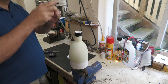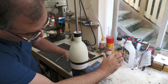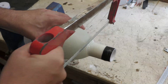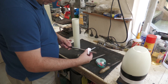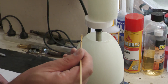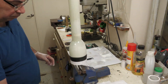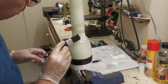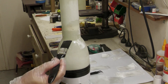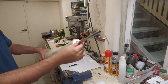Now it's time to attach the bottom end cap to the motor tube. The original mold is used as an alignment jig to make sure the motor tube and the end cap are aligned — we don't want any off-axis thrust vectors. After the end cap is aligned on the mold we cut off the end, which was done purely for construction. We then insert a stainless steel rod with a couple of 3D printed spacers into the motor tube and insert it into the top of the mold so everything is nicely aligned and centered. The two parts are tacked together with 24-hour epoxy and left to cure overnight. The next day we start layering strips of 85 gsm glass over the joint — using different sizes, some bias cut and some straight cut, to make the joint as strong as possible. There are at least 12 to 15 layers, with progressively longer strips to feather out the joint. The next day we pull it off and file down the inside of the joint so it's nice and smooth.